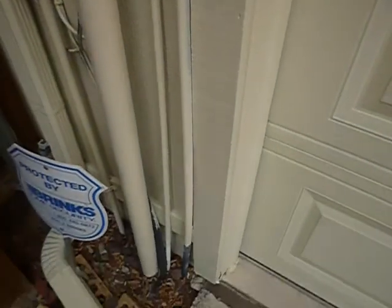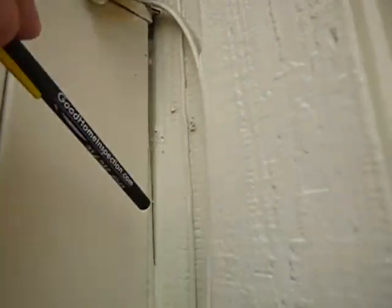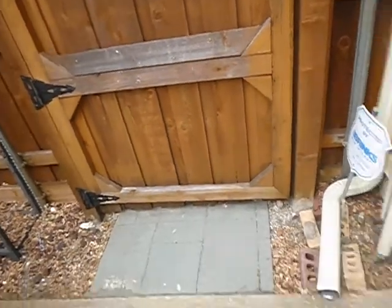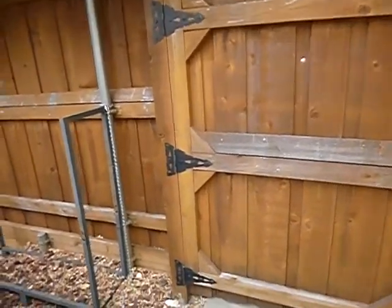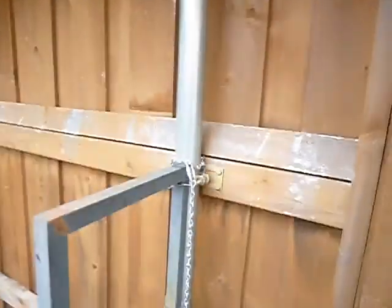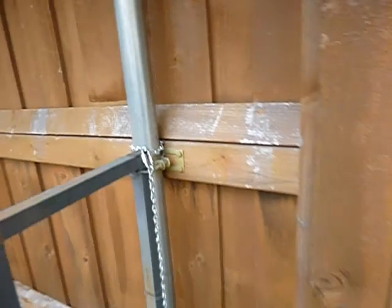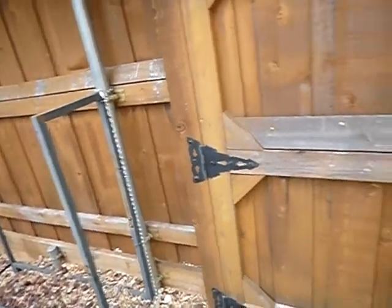Electric power to the house, below grade. These three sides, top and both sides, should have been sealed to help prevent moisture infiltration into the structure. This is about the swimming pool here, but this fence is installed inside out. These exposed rails, the old top rail, these rails make impromptu ladders. And then somebody's trying to mitigate this. See, you got the little slant jobber on there. I get it. They tried to mitigate it, but that is what it is.